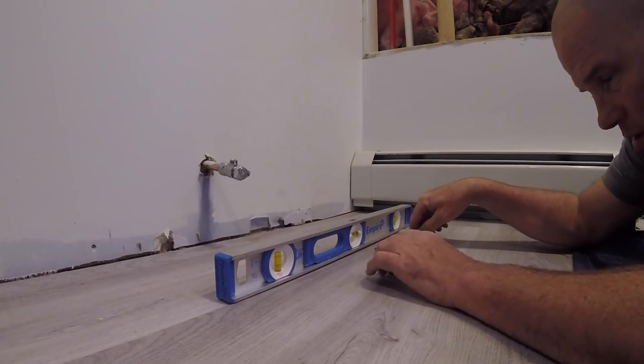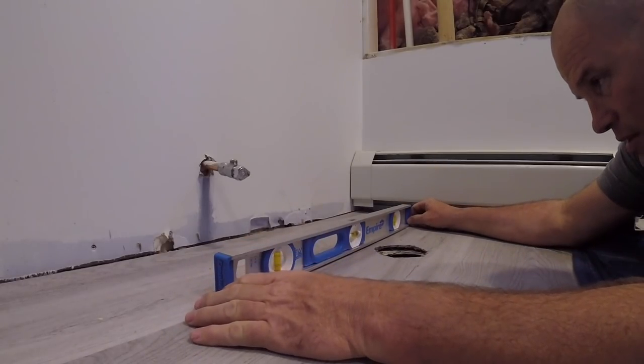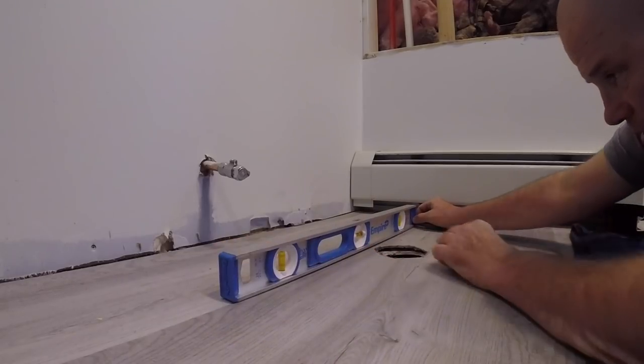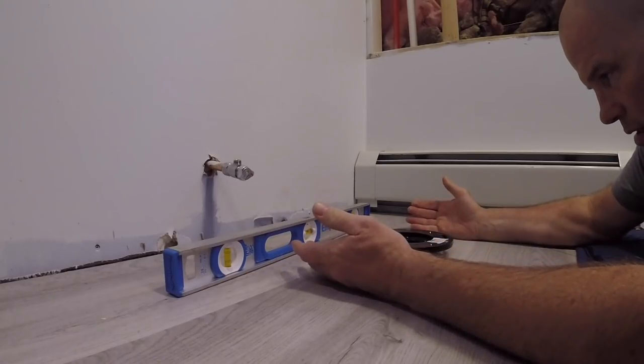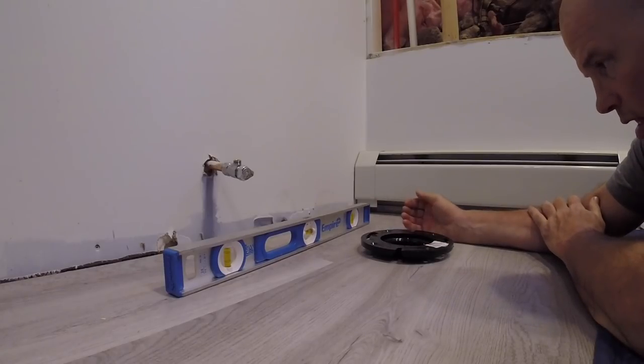They used plywood or some kind of finished laminate flooring. I thought it was going to be tile floor. The floor's still out a good 3/8. And that was the reason I didn't secure the flange to the concrete, because I knew it was going to be high. So now, we're going to just go with the floor. Got to do what we got to do.